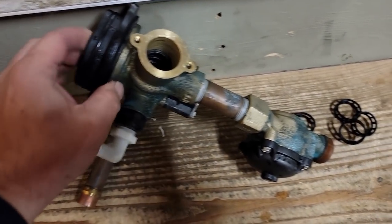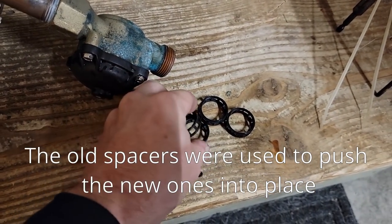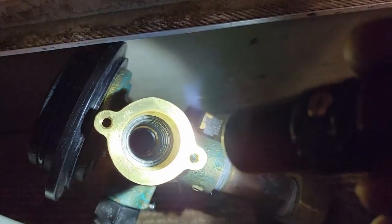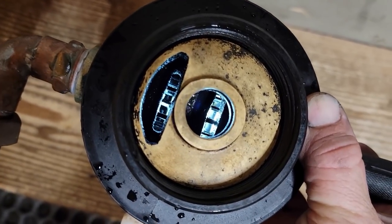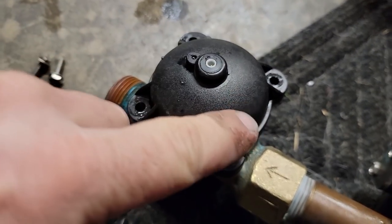We're going to get those lubed up and slid in. I ran a wire brush — inch and three-eighths OD — through there, going only one direction, then rinsed it out. Everything looks pretty good. To make it easy to see: spacer (nylon), rubber, plastic, rubber, plastic, rubber and so on, rubber at the top. Slide it into the brass body and hopefully everything seats correctly. We used four of the spacers to continue shoving it further in — now it's fully inserted, which you can tell by how the spacers line up with the cuts in the valve body.